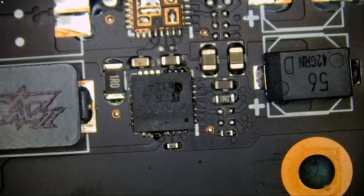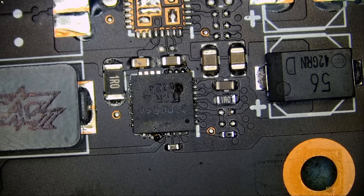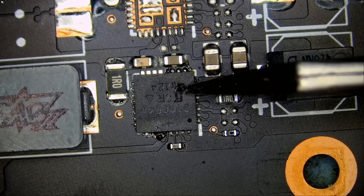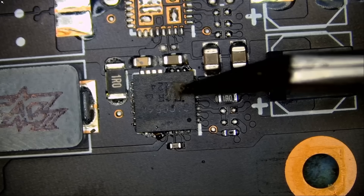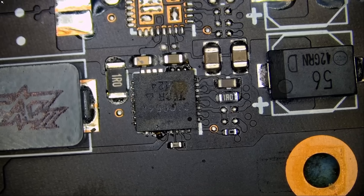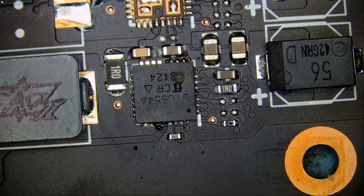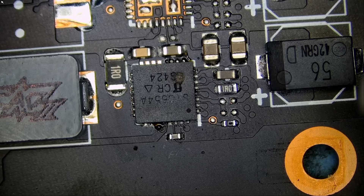Let me disconnect the card — what's down here? Oh look at this, we got it. It's obvious. Look at the damage here — the chip is blown. See that hole? We do see signs of burnt flux on the sides also. What is it? SIC 654A.